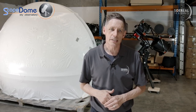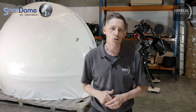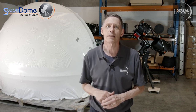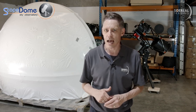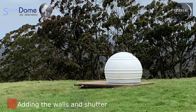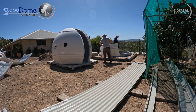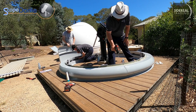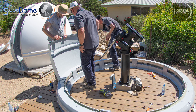Now we've got the ring assembly installed and tested, it's time to start building the dome superstructure. This doesn't take very long, but in parts it's a three person lift, and that's just for the three metre dome. Larger models - the four and five and a half metre domes - need some sort of mechanical assistance. There are five panels. The first one is the front panel. In the southern hemisphere this goes to the south, in front of your scope when it's in its home position. It's attached to the sandwiched outer ring cover and rotating ring using bolts and more silicone.